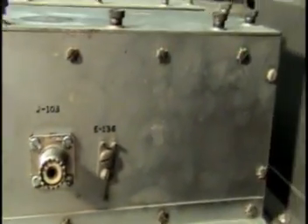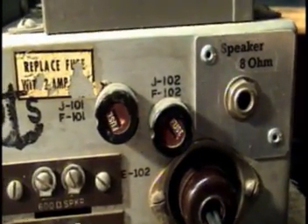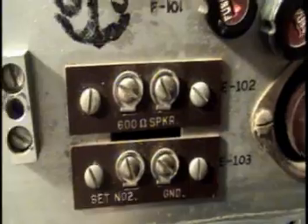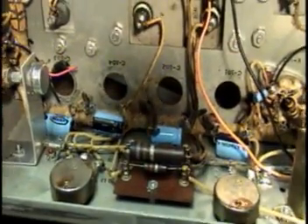On the rear of the unit I replaced J103 with a standard SO239 connection for easy coax hookup. Here's the ID plate and fuse holders, and up here I added a speaker output jack and put in an internal step-down transformer — it was only for 600 ohm, as you can see by this plate. Now this thing can be run like any other amateur receiver.